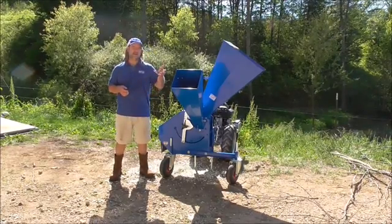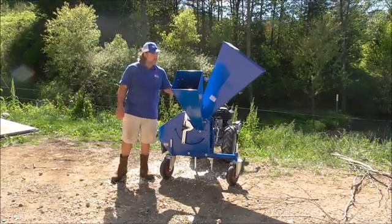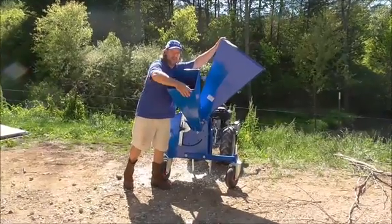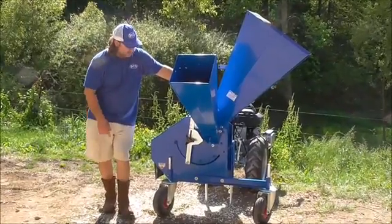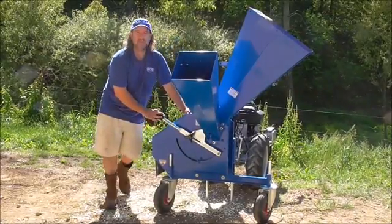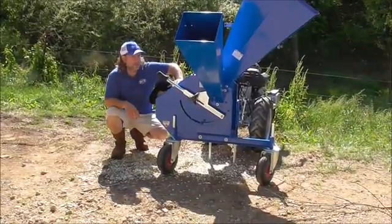We've got a stack of stuff here that we can chip. One really nice thing about the 150 model — the 80 is similar, although the mechanism works a little differently. If you're doing wet materials shredding through the shredder chamber, which is over here, this being the chipper chamber, and you get a clog, you can easily open a discharge screen. You can loosen this up right here, and then — bam — screen's open. Up underneath where the flap is, the discharge screen is open and clogs can be dealt with really easily.